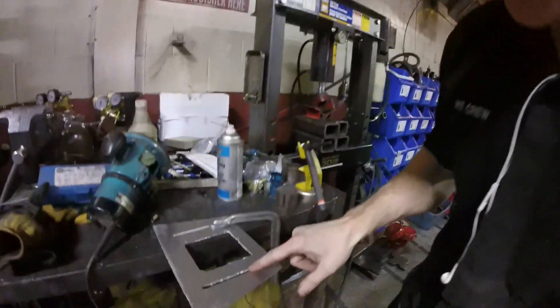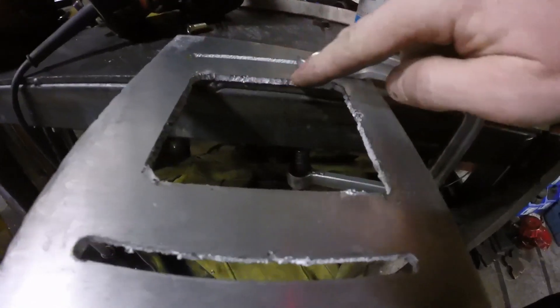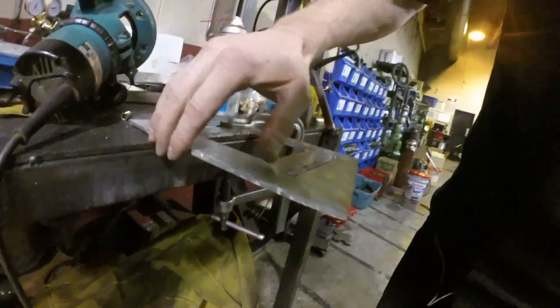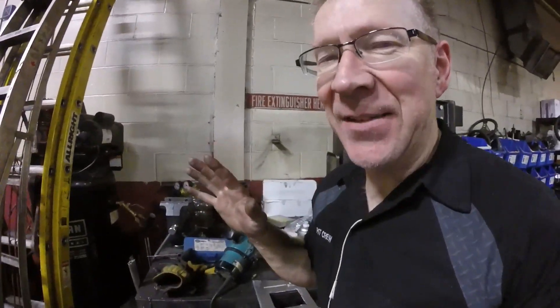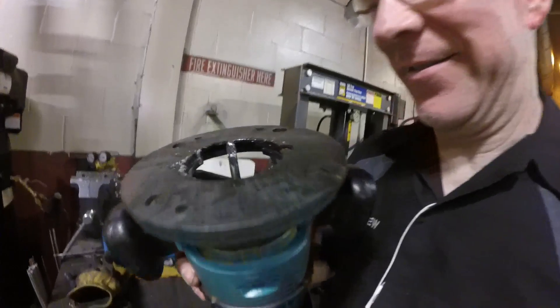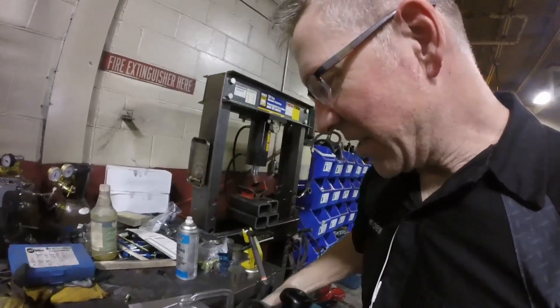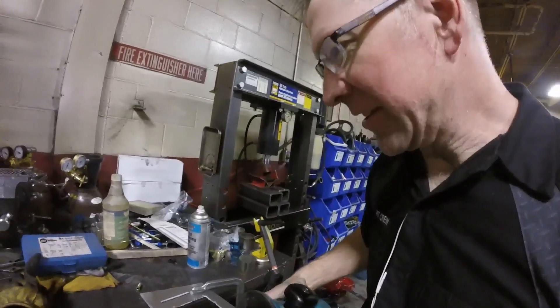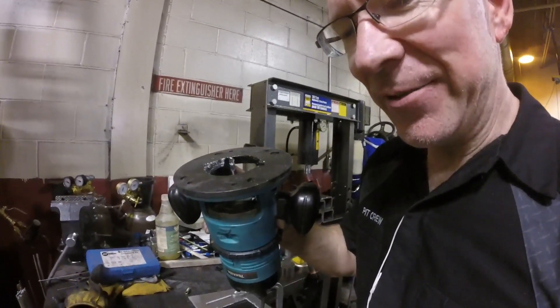I'm making this piece for my steering rack, and I used the plasma cutter as you saw. But I hate the edges — you can see there, it just doesn't make a very clean edge. The outer edges I can clean up on the belt sander, but the slot I can't. What I discovered — I don't know if this is advisable at all — is that the bits for a die grinder also fit in a router. So I'm going to try using a die grinder bit in a router to make this slot for the bolt holes really nice and pretty. We're going to give it a try.